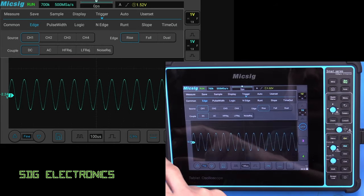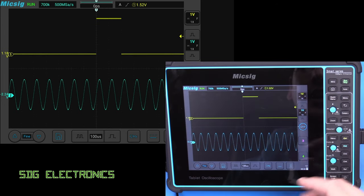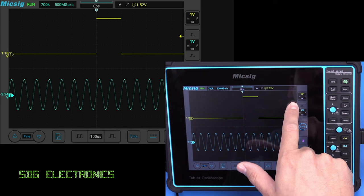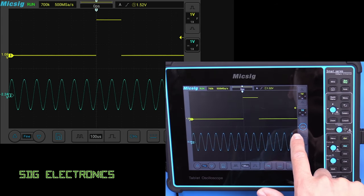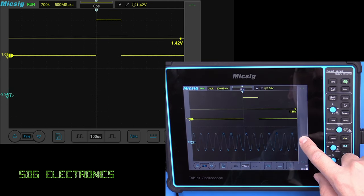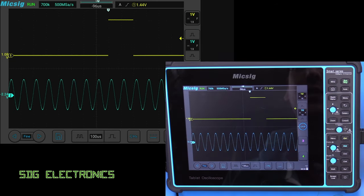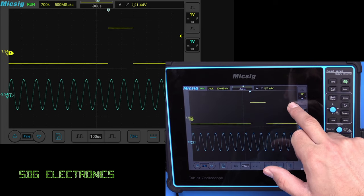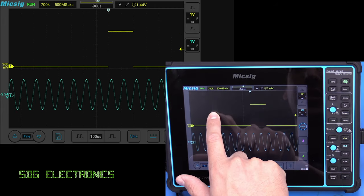You go to trigger and we've got things like edge triggering on channel one with the rising edge. If we swipe that back out of the way, you can see it's triggered. Now, the trigger level is shown in yellow and I thought you'd just be able to move it up and down, but in fact it moves the entire waveform. What you have to do is click on level and then use a swipey bar to move it up and down, which I think is a little bit counter-intuitive. It would be much easier if on one side you moved the waveform and on the other side you moved the trigger level, but at the moment it just moves the entire waveform no matter where you press on the screen.